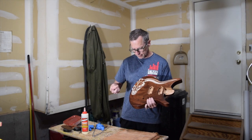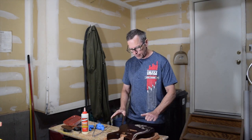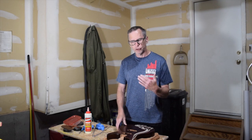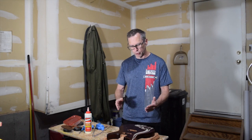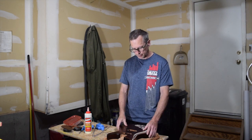In this piece, I've got a bookmatch top which was glued down the center, and I didn't want the oven temperature to separate it. Now I used Titebond on this, and to be honest I haven't had that many issues with the glue failing and causing the wood to separate. But that's not to say that wouldn't happen down the road, and I would hate to have a really cool looking design ruined because the wood separated. So going forward I'm probably going to switch to using hot hide glue when I glue these pieces together.